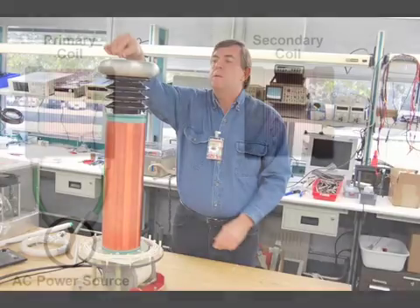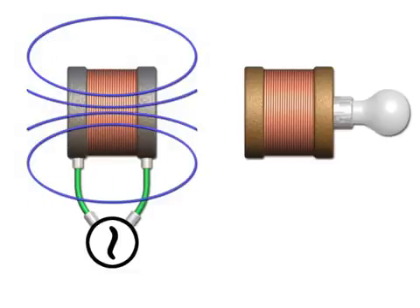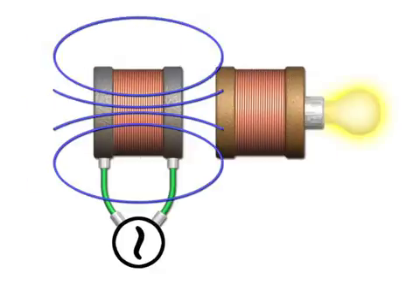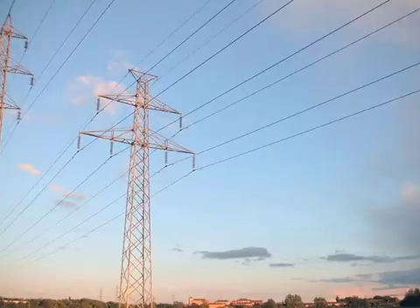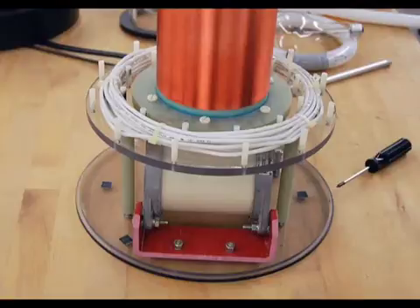But what is a transformer, anyway? Transformers transfer a voltage from one circuit to another via electromagnetic induction. A primary coil, linked to an AC power supply, experiences a magnetic field around it that, when close enough, induces a current in a secondary coil. When the secondary coil has fewer turns of wire than the primary, it takes on less voltage — that's a step-down transformer, like the ones used to turn the high voltage in transmission lines to a voltage you can safely use in your home. If the secondary coil has more turns than the primary, it will take on more voltage — a step-up transformer. In our Tesla coil, the primary coil has just 10 turns, while our secondary coil has 1,200. Definitely a step-up. It takes 2,000 volts and steps it up 125 times to 250,000 volts.